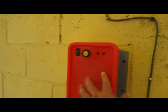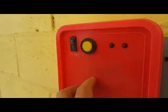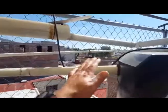And I got some loudspeakers here in case I want to play some sounds automatically with my Python script, like a rooster. And here I got my water harvesting system still functioning right. Inside here there's an IDEC Micro PLC that I refurbished, and I got some switches, push buttons, an on and off switch. I got some LEDs to show state and fault. Down there's a cistern that collects rainwater overflow. And this here is a buffer tank. This will receive all the rainwater collected by the roof system, and the overflow will then flow downstream to the cistern.